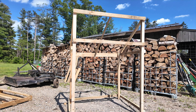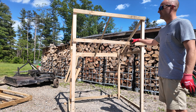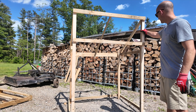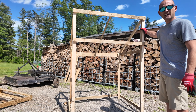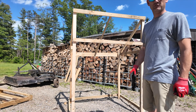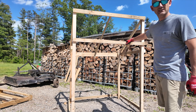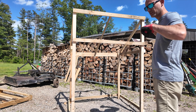It's very lightweight and can be easily dragged around. I used a lot of rough cut lumber I had around the house. It's six feet tall — I took a two-by-four and cut it in half, so these are two-by-twos. The posts in the front and back are two-by-twos, four feet high; these are six feet high. It's roughly about 40 inches wide, just wide enough to pull over the tote.